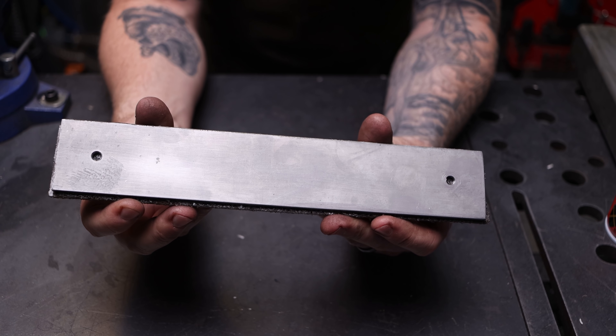It's the next day. You can see we've created a nice squishy soft platen with two quarter 20 holes ready to thread into our platen backer on the Revolution 2x72. I'm going to use some quarter 20 half-inch bolts with a lock washer, line everything up, and finger tighten for now. If you use bolts longer than a half inch, trim them down so they're not pushing through and creating a bump on the face of your platen. Now with it mounted, I'll line up the face with the front face of the platen wheel using a straight edge.